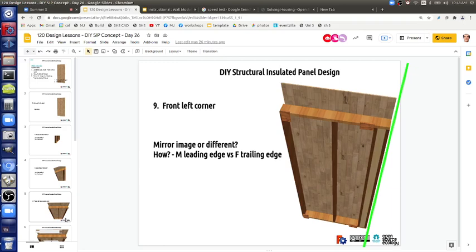There's a lot of constraint-based concepts here. Constraint-based, like the material kind of tells you that. We know we're still using the pre-cut 9-foot studs, so you know the height. So here I'm seeing, if you know everything about everything else, it's literally like one piece of information, which is that 1.5 inches shorter. You have to remember that. Wherever the top ends up, it ends up. Now, is that self-constrained? Yeah, it's a 2x4 in there, and you put the 2x6 wherever the 2x4 ends. Mm-hmm. You don't need to measure anything. You use the material itself to butt up next, make a fit.